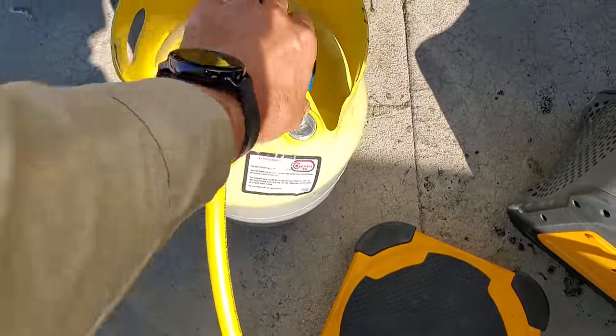And then you have stuff like this where someone else might just come in and change a compressor and say, yeah, it had a bad compressor, but why? Well, this is why. Okay, they're not going to solve it, but at least we know why. Same thing, dirty condenser. I didn't just stop at the dirty condenser. I checked everything out, looking at the big picture as usual.